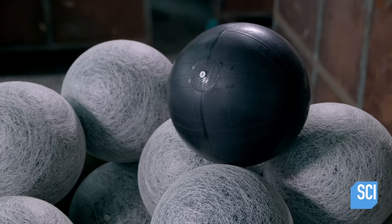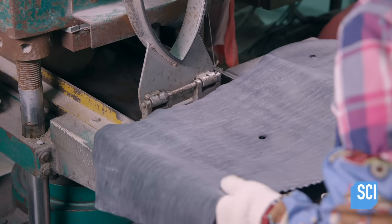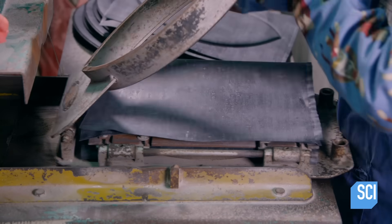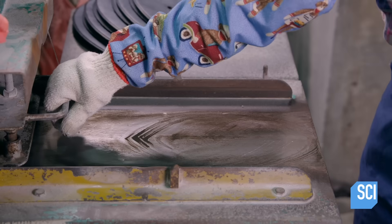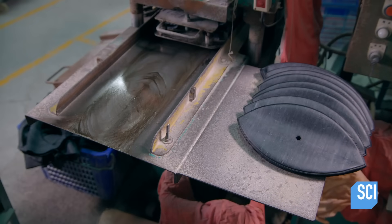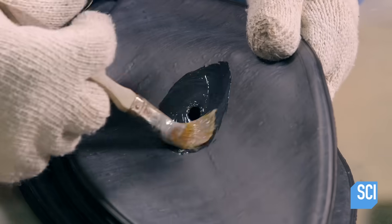At the core is an inflated rubber bladder. Making it starts with a sheet of natural rubber. The factory worker folds it in a specific configuration, then places a die on top and activates a press to force it through the layers, which cuts out the shape. He now has the bladder of a sports ball. He brushes an adhesive around the hole in the bladder and inserts a plug.